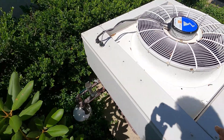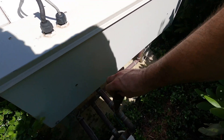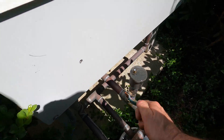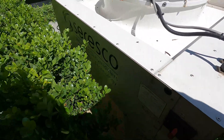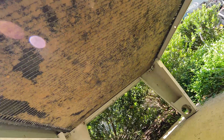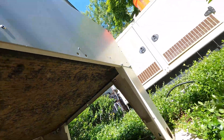Out by the condenser — it's not air-locked. The valve leaks but straight water is coming out. I'm going to pull the controls because I noticed the condenser is pretty plugged up, which is causing that high pressure. I've got to clean that up.